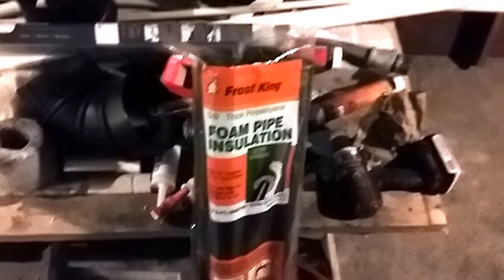once that layer is dried, I'm going to pull that piece out. And then when I go to the next layer, then I'll do the elbow up, wait for it to dry, pull that piece out, and then just keep on running it all the way up to the top. And that way I keep on pulling this out, but I'm going to have that whole tube set up right in the cob, and I won't have to run any steel pipe or anything like that.